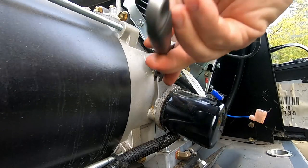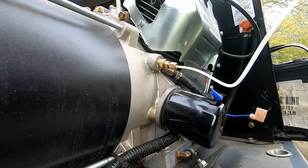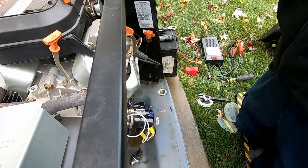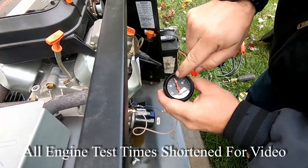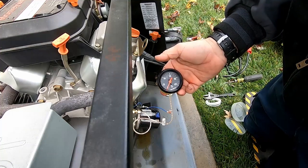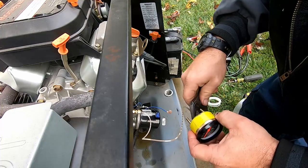It's not very often that you get these oil pressure failures — I think I've only had to use this thing once or twice in the last six or seven years, actually longer. I started doing these in '06. Let's go ahead and start it — put our ear protection back on; it doesn't seem loud at first but it adds up. We had about 57 PSI each time, so I'm not going to assume we have any issues with the oil. As of right now, it appears we had a defective oil pressure switch.